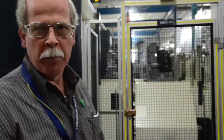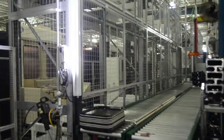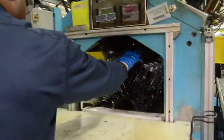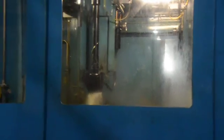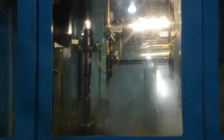You see one of the pallets bringing a block onto the fixture, which will deliver it to the machine. We run every product, every day. All blocks get the same process — we press the sleeves in on everything from the two cylinder up to the big ones. This is our final machining operation, which is to hone the cylinder bores. We size them to our finish size and create the crosshatch, which gives the surface finish for oil retention.